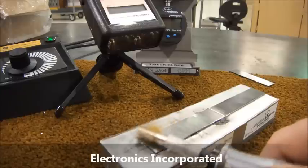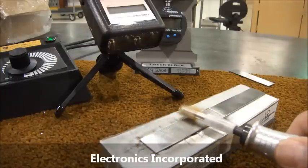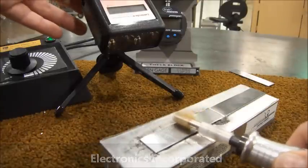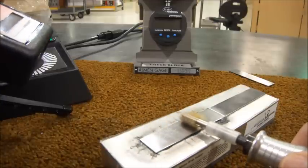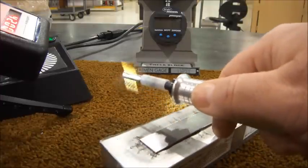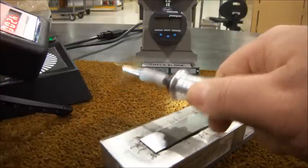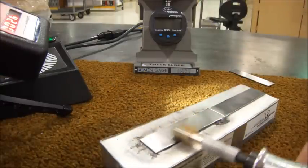The video won't capture this well, but the surface of the new strips makes it much easier to examine the coverage, even before you use magnification. If you determined the required RPM while the flap was free spinning, you can periodically check the RPM with the stroboscope as a look-aside device. Now I'll change the motor RPM to be 4200 while spinning freely — again, this is for demo purposes only. You should stick to one method for accurate results.